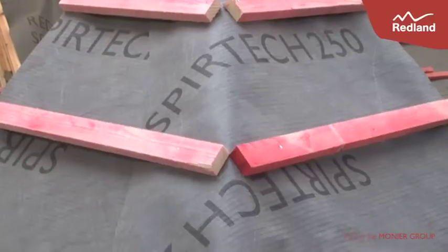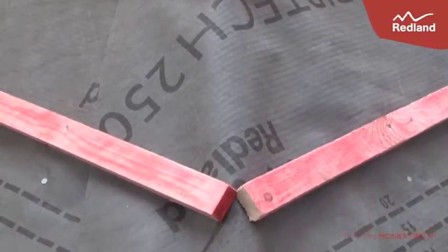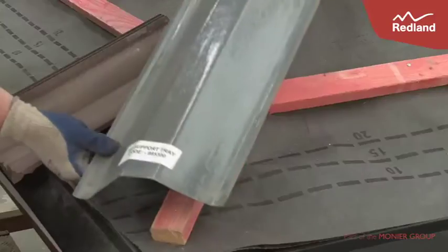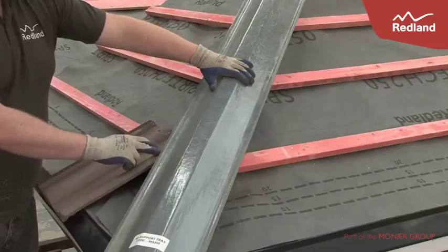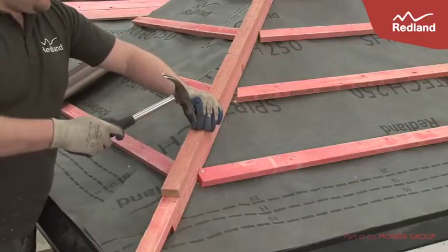Install underlay and batten the roof with ends of tiling battens supported on the hip rafter. At the hip, build up either 38x25mm or 50x25mm tiling battens to a height so that the hip support tray, if used, just rests on the hip batten and slates and tiles either side of the hip. If the hip tray is not used, the hip batten must allow for 15mm penetration of the wood screws into the hip batten. Nail the built up tiling battens together using galvanised steel batten nails.